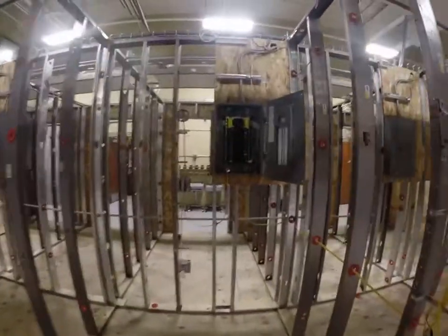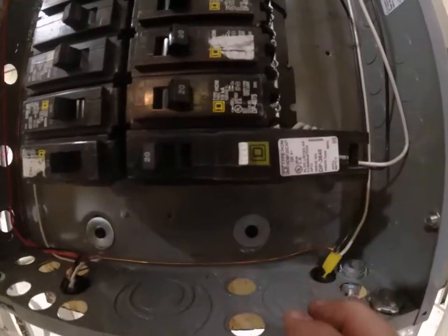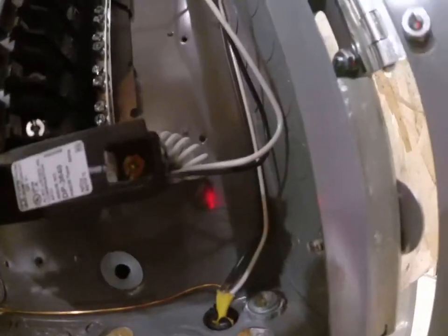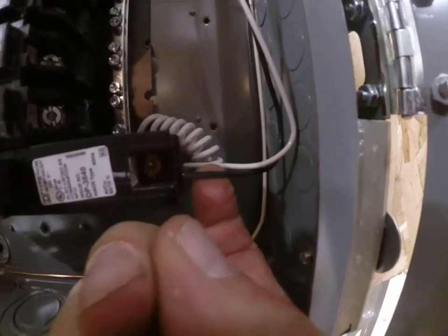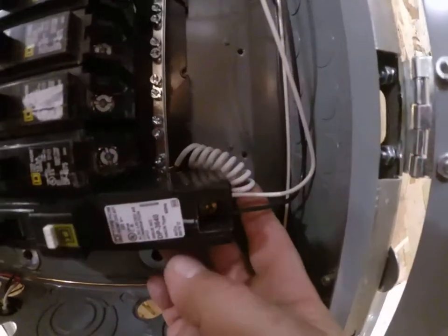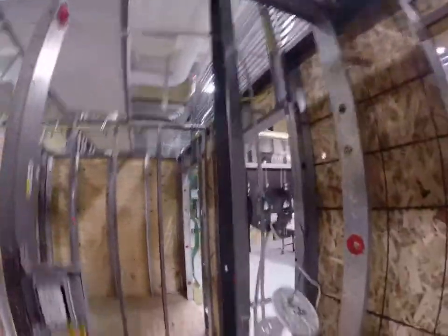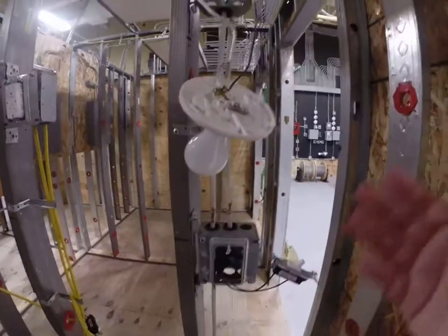Let me show you what I've got wired in here. My circuit breaker is wired in, my branch circuit is tied in as it should be. The ungrounded circuit conductor is tied into the brass screw, the grounded circuit conductor or neutral is tied into the neutral screw, and the pigtail neutral wire that comes attached to the breaker is tied onto the neutral bus as it should be. This branch circuit leaves the panel and comes down into this little experimental setup.